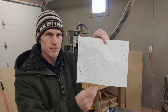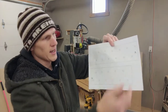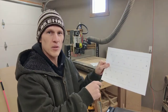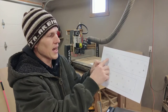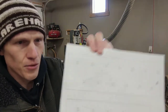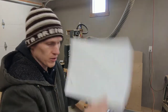I created this template. You can just cut it out, and then it's too long for one piece of paper, so you just tape those two ends together, A to A, and then you can glue or tape that to your board, and then just drill it. I'll put a link down below in the description for this template. You can use graph paper or just print this off. I have it so it's 1.5 inches on center. It's nice having it so you can see exactly where to drill. You can make it bigger or shorter, longer, whatever you want. Just something pretty simple to make yourself, or you can just download this and do it.